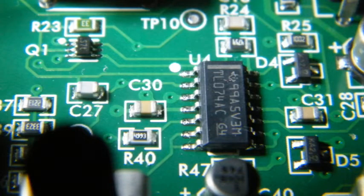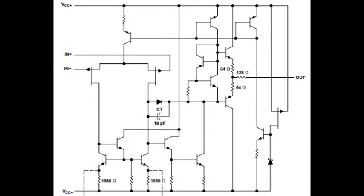Well, the VCO. At the heart of the VCO is the TL074 IC, a circuit containing 4 identical operational amplifiers, each equipped with JFET input transistors. The TL074 guarantees low noise and low harmonic distortion, what makes it a simple but great device for audio applications.